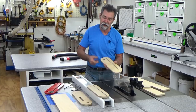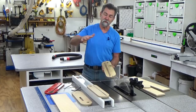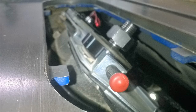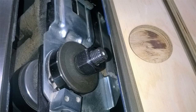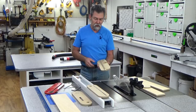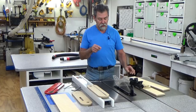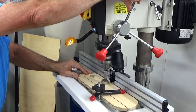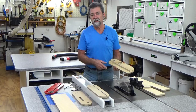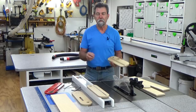Now we need to create a 45-degree cut for it as well, and also an area here for the outside of the arbor when the trunnion is rotated over to 45 degrees. The outside of that arbor comes almost up to the top of the table — only about four millimeters away — so we create a large hole there. I created one that's two and an eighth inches in diameter and that has worked quite well. Be aware that the trunnion travels on an arc away from you. I take the blade out, raise the arbor all the way up, swing it to 45 degrees, and put a mark on the table with a pencil. We then take this over to the drill press and stop around four millimeters shy of the top of the plywood. This applies to my saw because it's dado capable, meaning the thread on the arbor extends further than it does on a saw that can't have a dado stack.